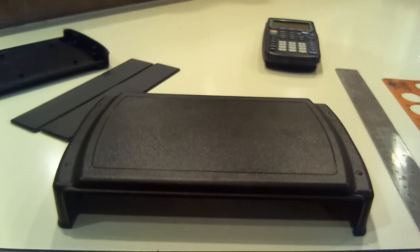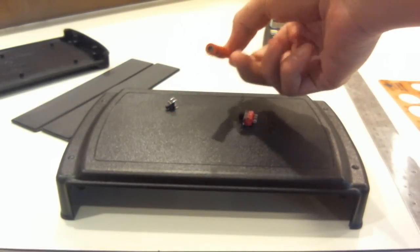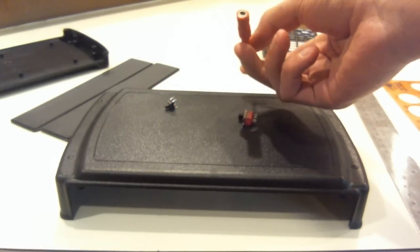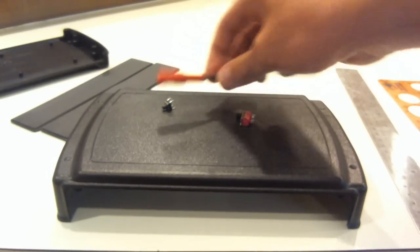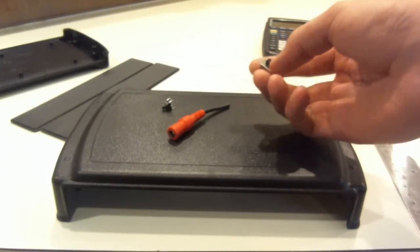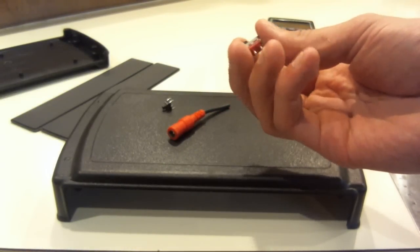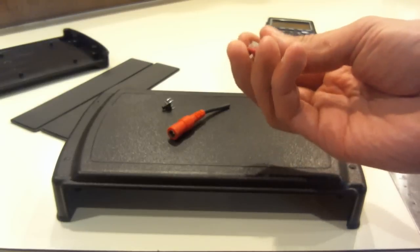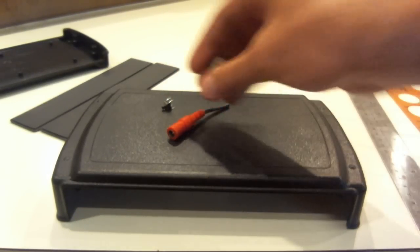The things we're going to need for a case that I didn't show in the first video — well, I showed the tack switch — but we're going to need a charging jack. This is a jack from the eBay screens; you can just cut it off. I like to use them because it comes with a screen. Then this is just a switch — make sure you get a bigger switch. This is a 6-amp switch, so it's good enough to cover higher voltages.